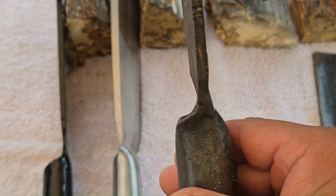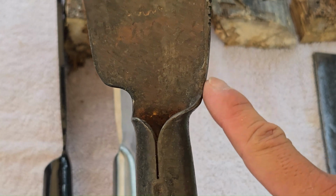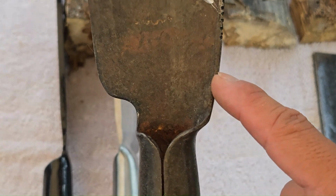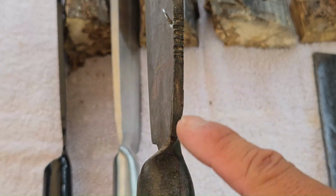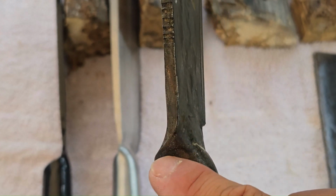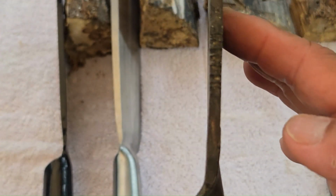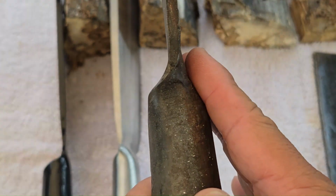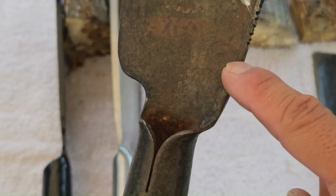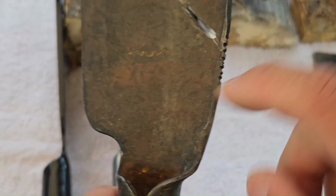But yeah, I made the mistake of, you see this rib here? This rib is really crucial for reinforcing the weakest part of the structure, which is right here, right? So this is thick. This is really thick, right? So there's a lot of reinforcement here to offset all the force that would be applied right here. So these ribs, when they bend them in, they actually create a reinforcing point. So it's good to have these ribs.